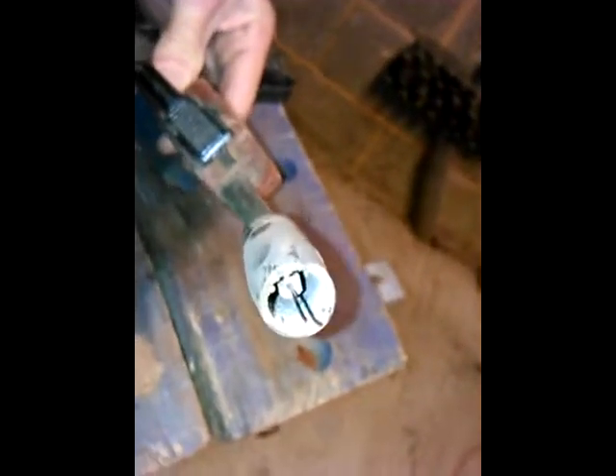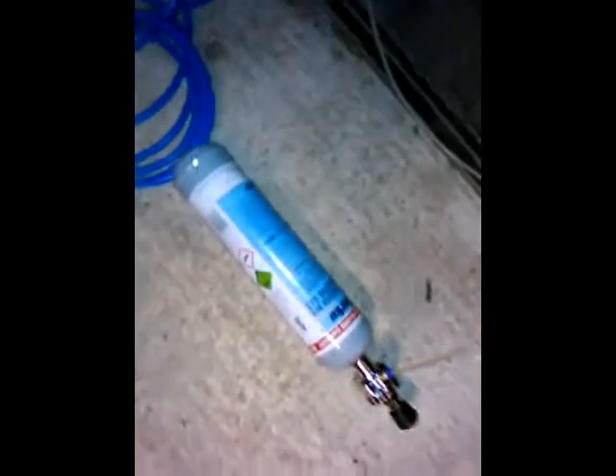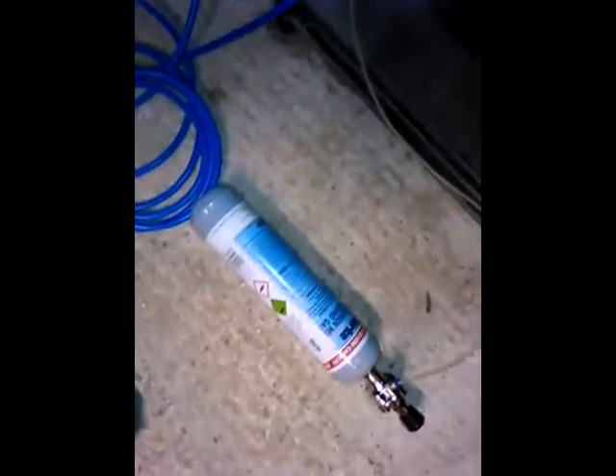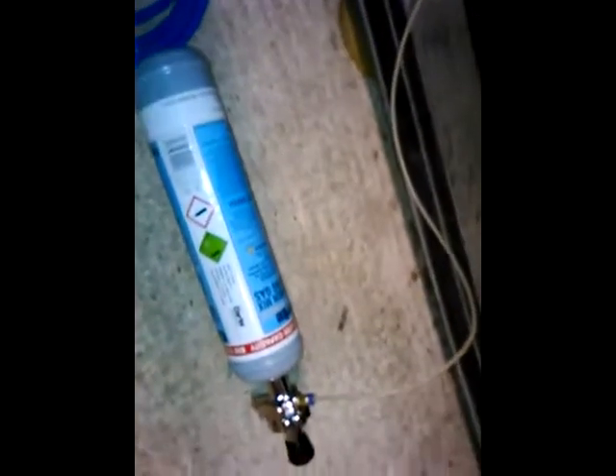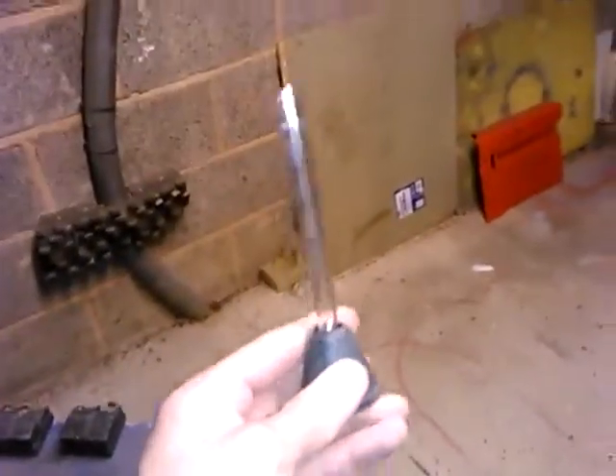Around the outside of the wire we have what's called shielding gas coming out, and that comes from this bottle of argon here, which is the inert gas. The purpose of this is to stop the very hot metal rusting very quickly, which would affect the quality of the weld. I've got the wire installed in the machine - I don't leave it there normally because it goes rusty - and I've got the gas connected up but not turned on yet.